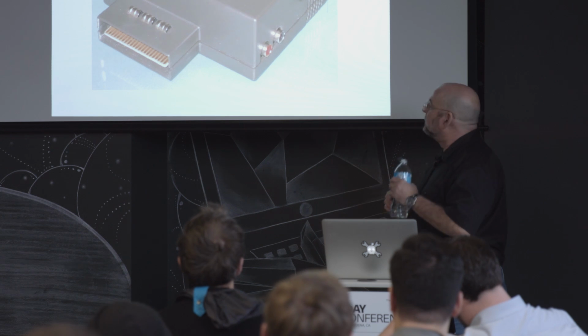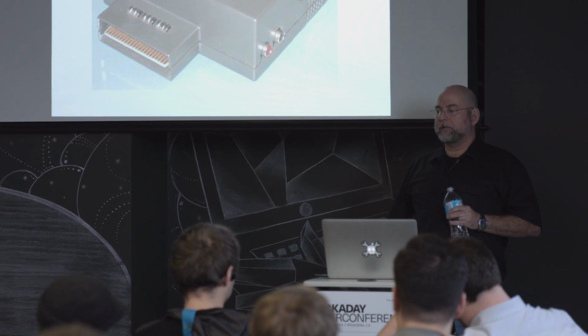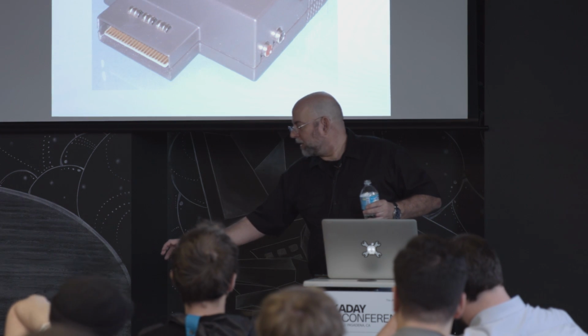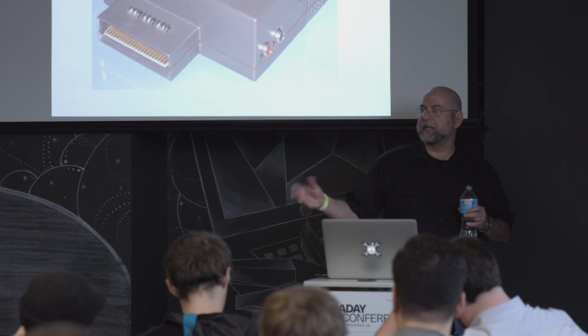What this did was, unlike our other cartridges, which had a solder, you would solder a jumper if you wanted to be a game cartridge. Well, this thing plugged in, he said, I'm not here. You're not? Now just draw on power. Okay, let's go for the reset vector then. I'm here! Right as you reached for FFFC, if you know your 6502, he slammed the bus. He said, that's me. He did it dynamically. I'll tell you where to go.